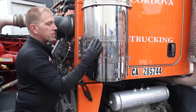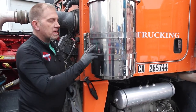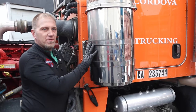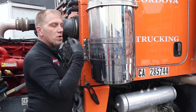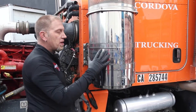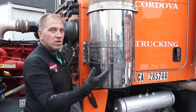What back cutting is going to do — there are two main functions of back cutting. Number one, it spreads your compound down so that you're going to get a nice even coating of compound on this part, and you don't have to load up as much when you go to do your next cut going upward. Two, the back cut allows that metal to go ahead and heat up. It allows the metal to stretch, the pores to stretch, so it's going to take the compound on your next pass a lot easier and a lot quicker.